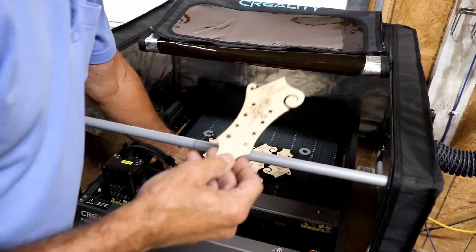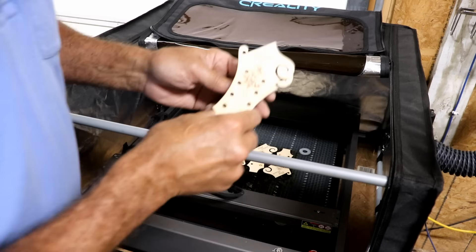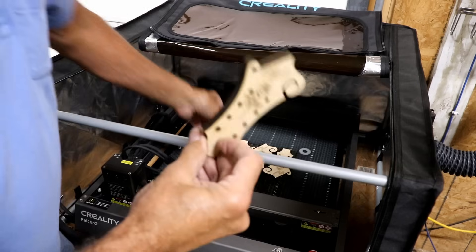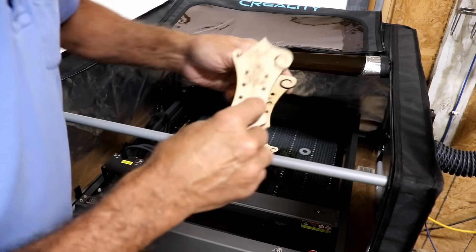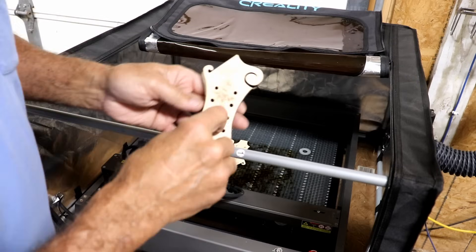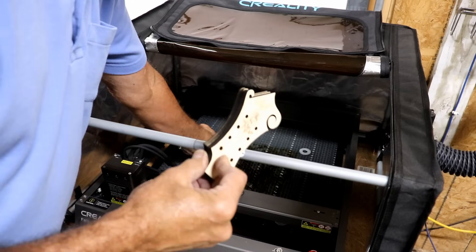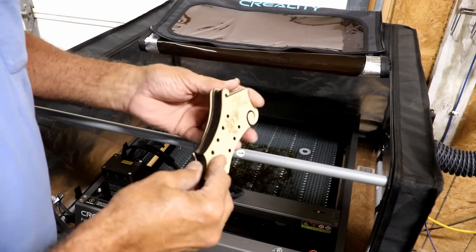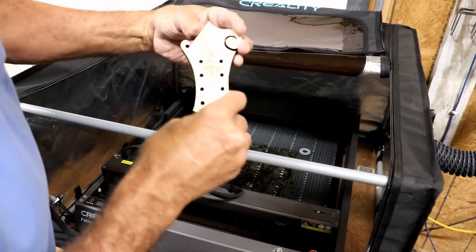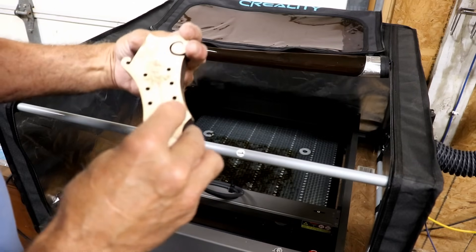You can see the holes did cut through, and the etch was dark — that's good. I wanted the etch a little darker than before, so I actually bumped the power up to 75 just before I sent the job: traveling at 370 speed and 75% power. It did a nice job etching this time. You can see how precise these things are — every single one of them lines up perfectly, all the holes line up, you can see straight through. It's perfect.